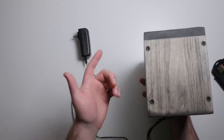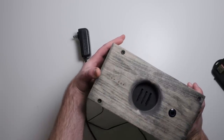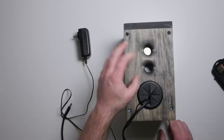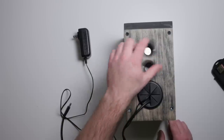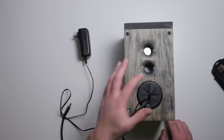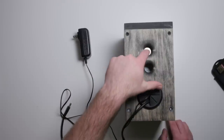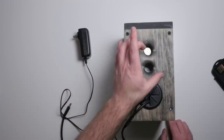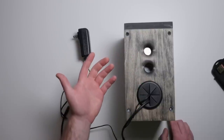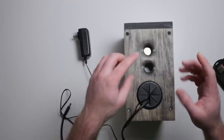On top I just used wood screws and painted it black for the whole thing instead of sealing it completely, because I wanted to potentially upgrade it and make changes if needed. Now at the back of the unit there are two holes — I was going to have two 12-volt fans, but the second fan wasn't working since these parts I pulled out of old enclosures, so one was dead. Normally when I'm using this I have tape over the second hole, otherwise the air would just enter and exit immediately without going through the unit. If you're going to do this, I would use a larger fan or two little fans. Right now the one fan seems to be doing a good job. Air comes in the bottom, cools all the units and hard drives, and then exits through the hole.